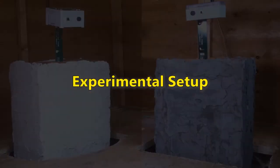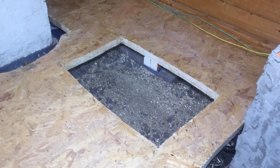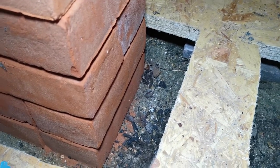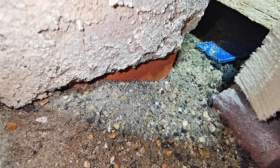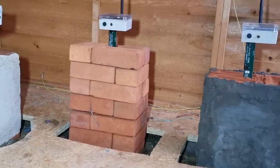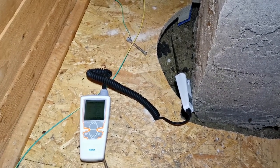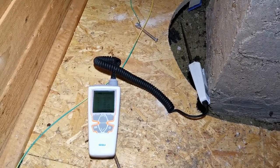So let's talk about how we set up this experiment. We built our test walls directly on the soil, replicating an old internal wall where the only source of moisture is damp rising from the ground. These walls were otherwise completely protected from the elements or other sources of moisture, in a non-heated environment without temperature differences, which is a non-condensing environment.